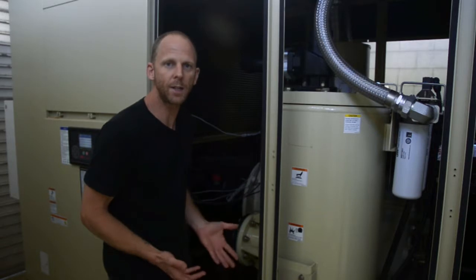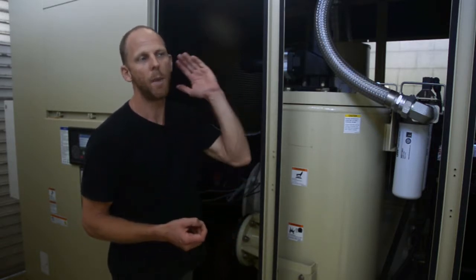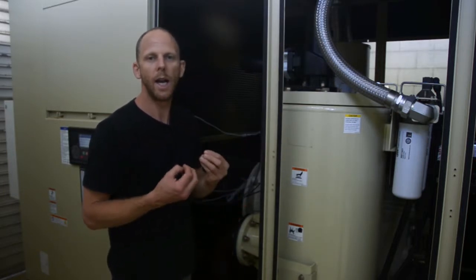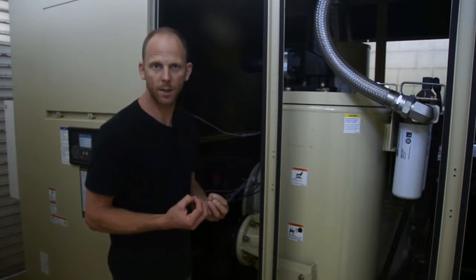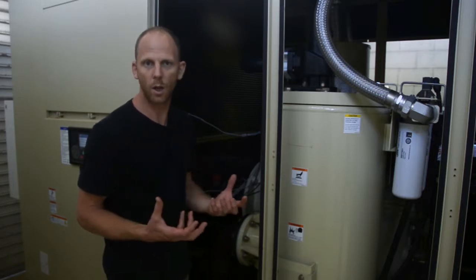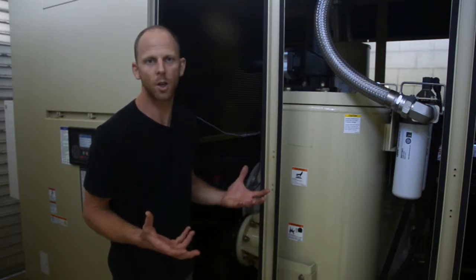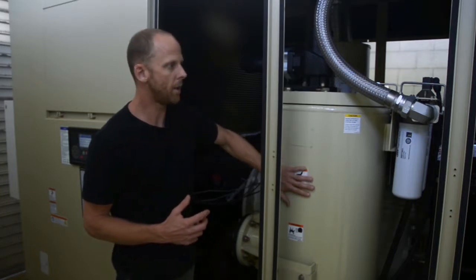The reason we don't want any oil in our airstream is, obviously, we don't want our oil levels inside our screw being depleted over time, but critically we do not want any hydrocarbons making their way through to the air separation process. As you may know, any hydrocarbons that accumulate inside our liquid oxygen inside the columns can cause spontaneous combustion, which obviously is disastrous. So the oil separator is a very, very important piece of equipment.